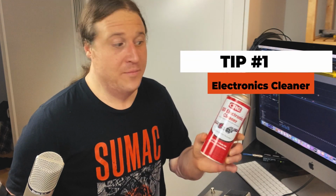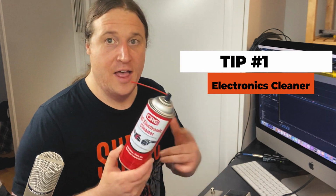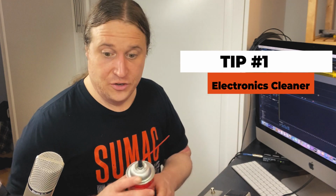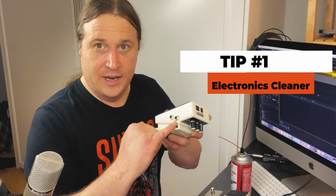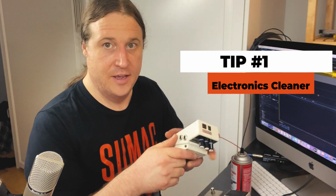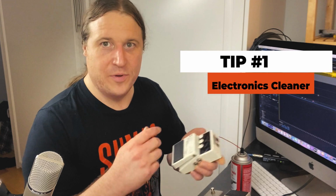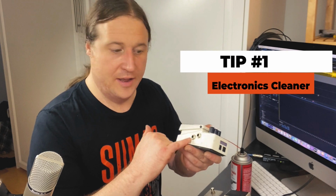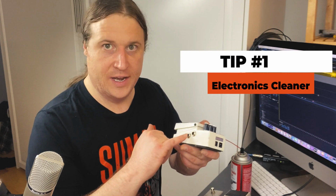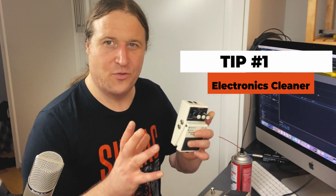So as mentioned at the top of the video, I do have some advanced tips for you. The first one is get some electronics cleaner. This one isn't, but if you can find one that is a contact cleaner, those work great. What you can do is use them to spray. Here I have one that I didn't put on. You can spray out the connectors where the input jack goes in. This can get full of grime, full of dust and dirt. You can open them up and give them a touch, but if you want to keep it safe, you could just do the contact and the input jacks here. Really goes a long way. Keeps it from getting noisy and kind of crackly.